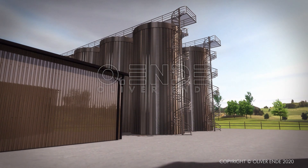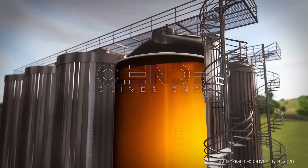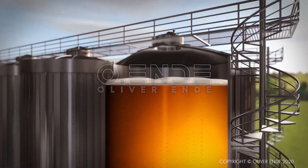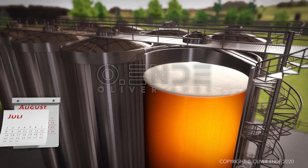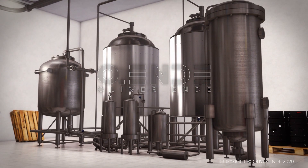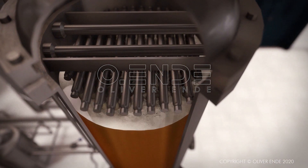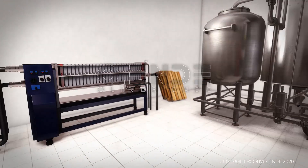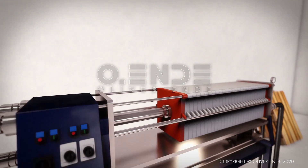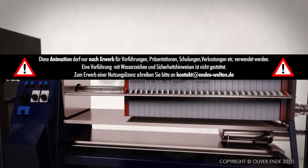In storage tanks, the secondary fermentation process continues, where the remaining sugar is converted into alcohol. The taste is refined and carbonic acid is bound. The remaining yeast and protein sinks to the bottom. Depending on the type of beer required, the young beer stays in the storage tanks for up to three months. By using Kieselgur filters, yeast and other undesired sediments are removed. Subsequently, instead of pasteurising by heating, a plate and frame filter press can be used, whereby the beer is slowly pressed through individual layers of cellulose filters. This procedure is used for bright beers, such as pils.